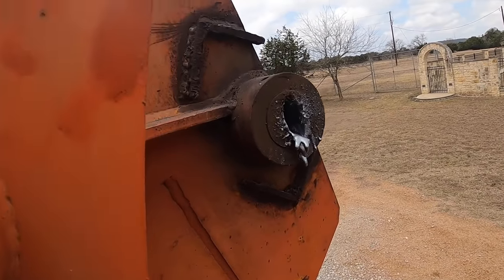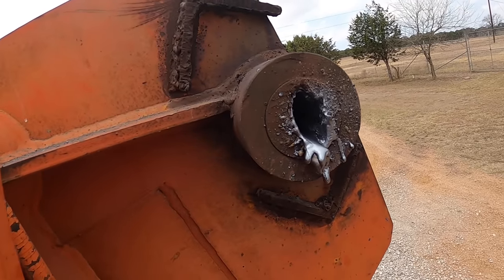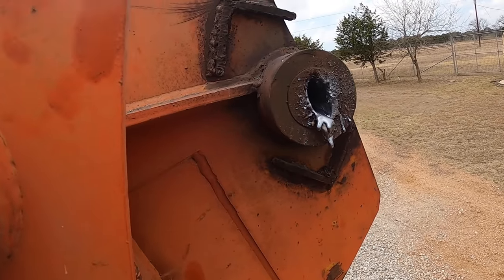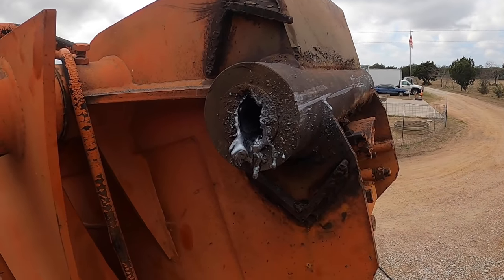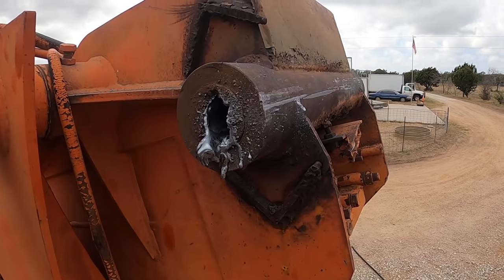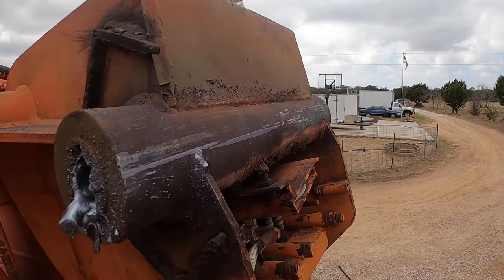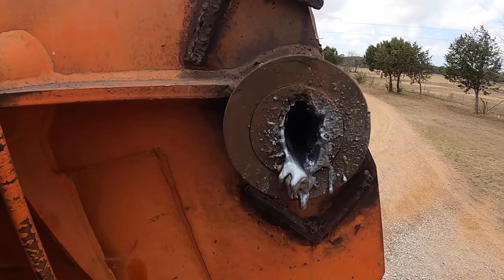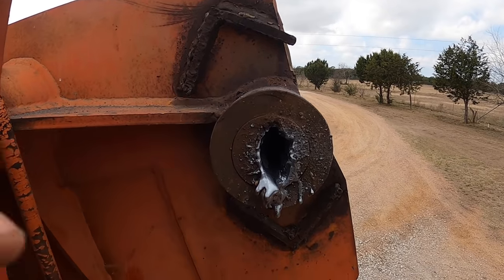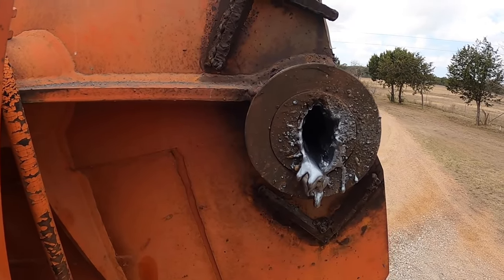Okay, well, this one has been fighting me every step of the way. I don't think I've ever had one give me this much trouble, but that's why they call it work. They don't call it fun. Well, it's kind of fun, but either way, this is hot, and I have heated this bore very hot, so I'm going to get some water and cool it off, and hopefully it will shock the pin so that it shrinks just enough to tap out.